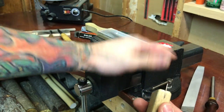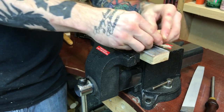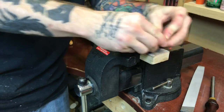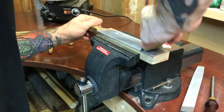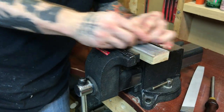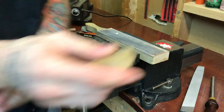The idea is that you get a sharp wire edge on both sides and you scrape off the unwanted material from your strop. It's literally that easy — you can do it both directions, you can use both sides. But as you're doing this, just like it takes material off your knife, it also takes material off your scraper. And your scraper will not work if it does not have that wire edge on it.